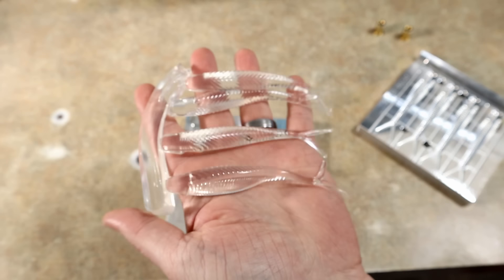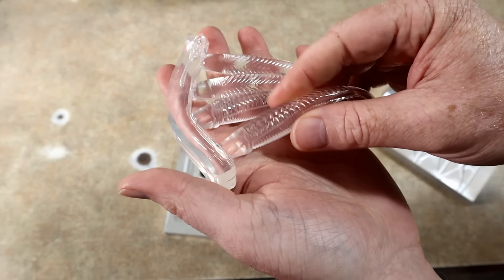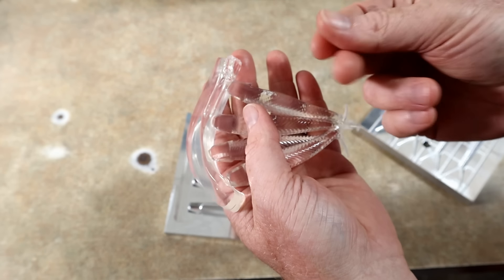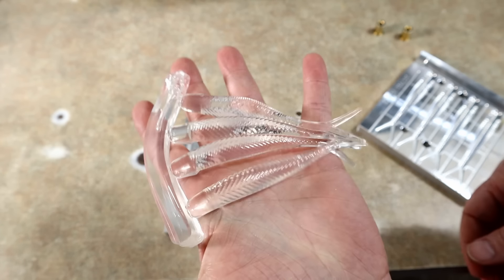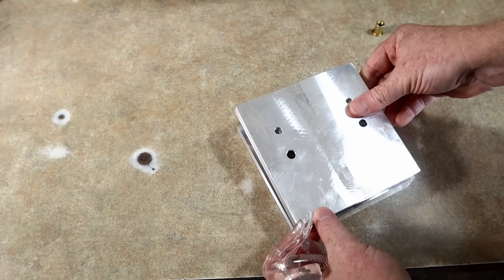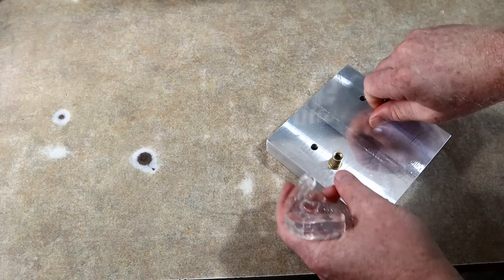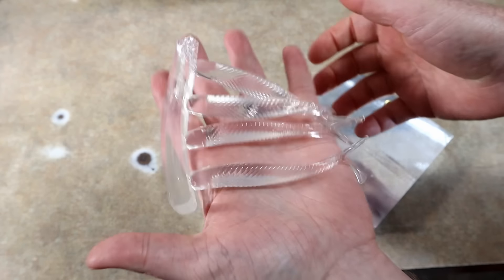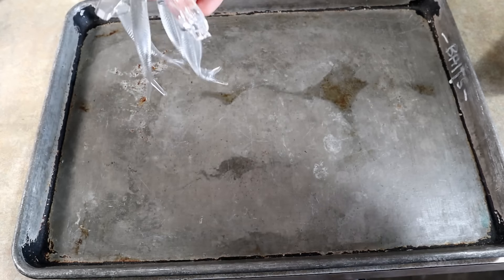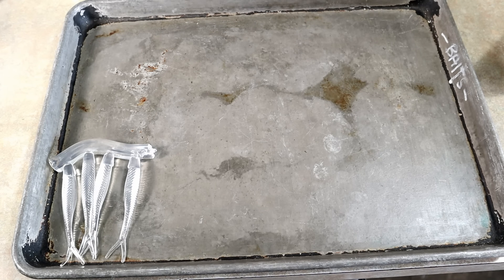First impressions: it's very light — it's not quite the heavy dense feel of the sinking plastic. Different ingredients, different resins. It also sets up very fast and dry, so it doesn't have any of that tack you might experience with the black label. It's going to set up and feel really dry to the touch right away, which is very good for mass injection — when you're running the molds, the faster it can set up and peel out cleanly the better. We're going to set these out as examples, first run far left, then go in order for compare and contrast.